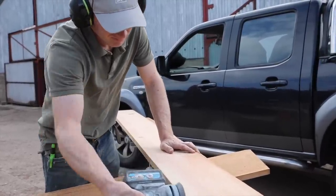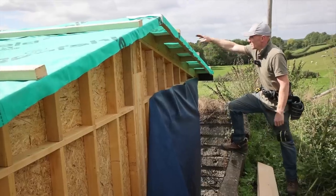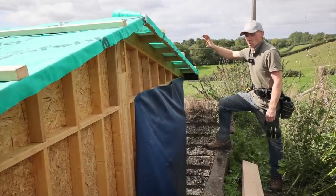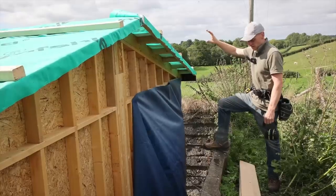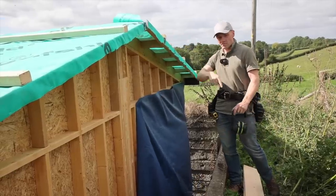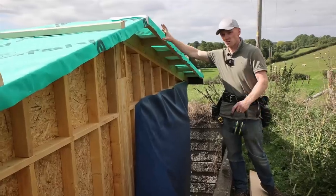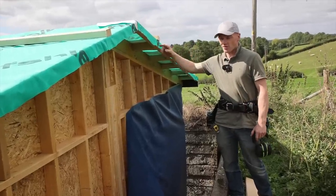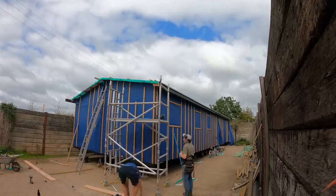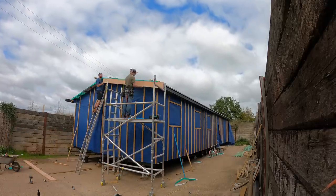The rest of them I'm going to be cutting down and planing for window trims. We've measured everything up so we're going to fix them onto the end of this ladder. We've decided to set them down from the top so they hang down 200mm, and then when we put our barge board trim - the black painted finish that came with the roof - it will come down and cover about half of these boards but leave a nice feature bit of timber board underneath. It just makes it look a little bit more like a substantial building rather than having a really thin roof line. We'll paint them once they're up, before we put the metal trim on.